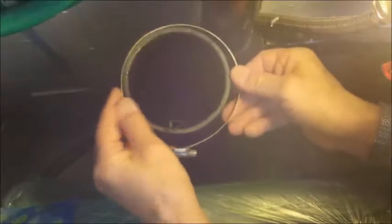You can see the support ledge down in there. This is the filter support and it just slips right down on top of the ledge, and then the filter just sits right down on that. There's a bit of space between the four inch pipe and this two inch support, so I'm going to take a shim — a little piece of oak — put it between here and put a band around it to hold it in place, then tighten this up against there with two tie wraps. That's good and tight. As far as the filter is concerned, these do seem to be on here pretty well, and then this will just hang down in there. I just drilled a hole through the top of the tube here and have tie wrapped this around so this doesn't pop out when the pump is running to evacuate the water.